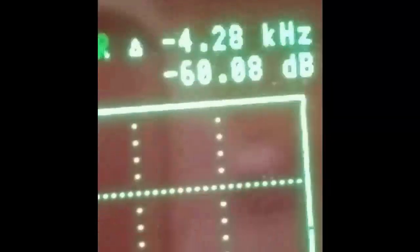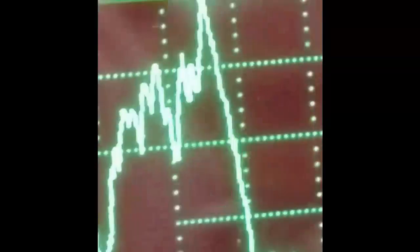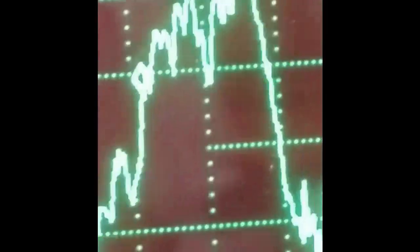So that's 2 kHz up. And at 4 kHz up, we're about minus 60 dB. If we check the lower sideband, we're also in the minus 60 dB range at 4 kHz. But that's 4 kHz from the peak level of audio in the upper sideband or the lower sideband. So this is the voice channel right in here — all of this is the voice channel.